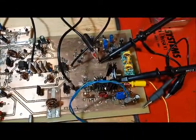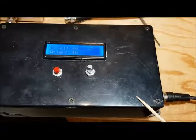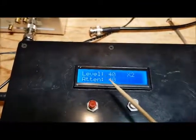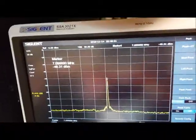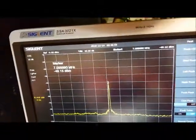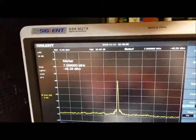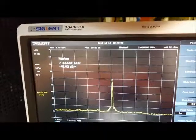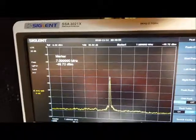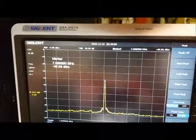The IRF 510 is getting hot at this point because I've been running it for a couple of minutes at that power. I've now connected the attenuator with 40 dB of attenuation to my spectrum analyzer. The output from the attenuator is approximately minus 49 dBm, so the power required to drive the power amp to get just about 5 watts out is minus 49 dBm.